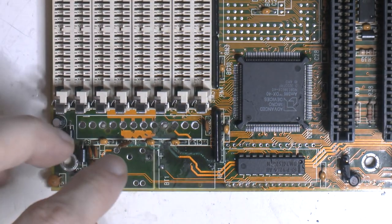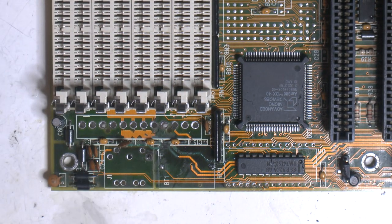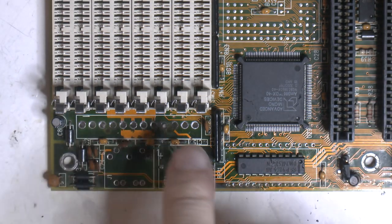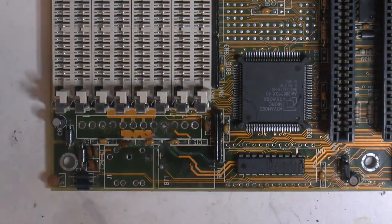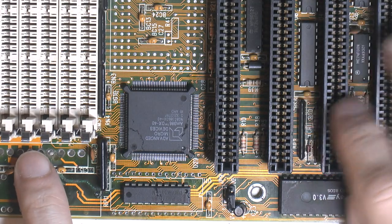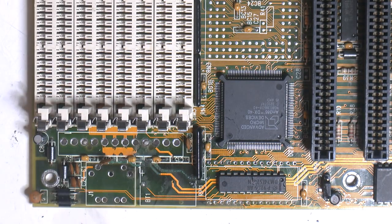I think we have this loose now. We're gonna check the ISA pinout for the voltage rails. They all go there as far as I can remember. So we can probably continue to check between here and an ISA slot over here. So make sure we don't have any traces that are broken off. I'm mostly wondering where the negative 12 goes, if it's in a layer in between or something. And then we need to check this one, so it should go over to here.